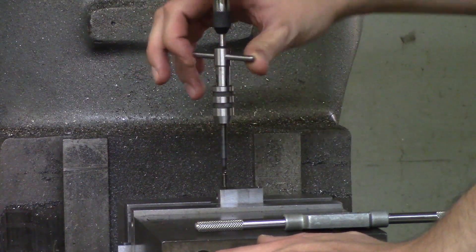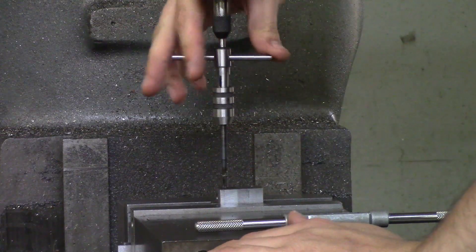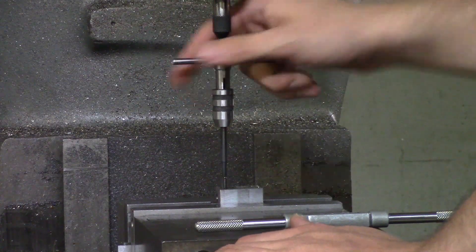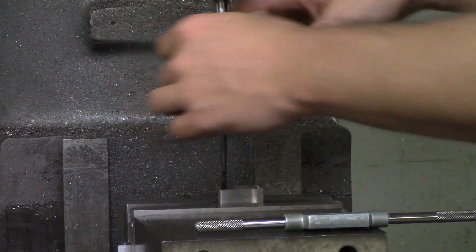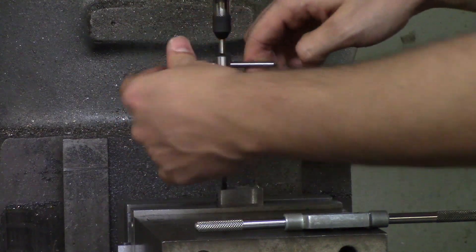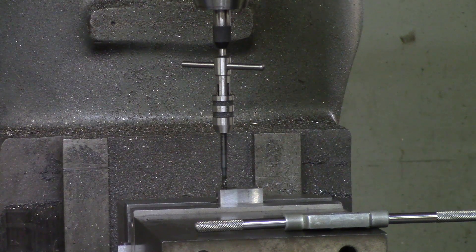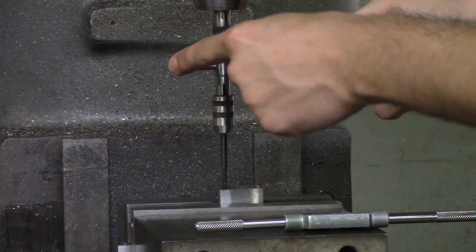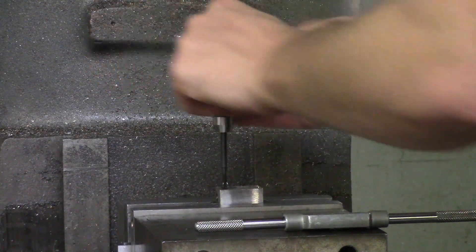While you're tapping, you can use your quill to slowly go down and follow along with the tap handle. You want to go just until the tap stops, because if you keep going it's going to break off — it will hit the bottom of a blind hole. I want to use my quill to ensure that my tap guide is still touching my tap handle, and then I'm going just until it stops. Once it's stopped, I can back off and remove my tap guide completely, then back my tap out.